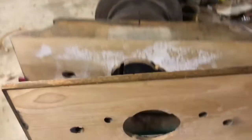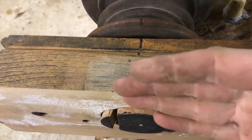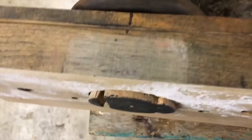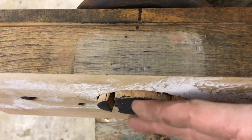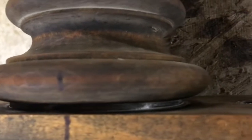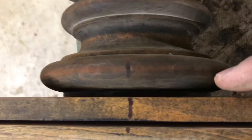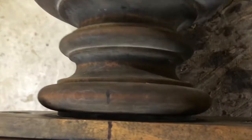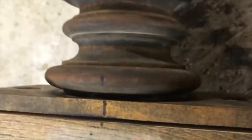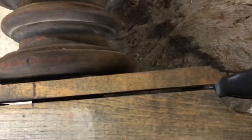All right, so I was able to get the outer layer of this leg off. And what that did was it gave this part enough access to where I could lightly tap it that way and allow it to slide up this metal peg that holds the leg together. And what I had to do is get some wood glue down in between this crack because I wanted the glue to be solid, you know, the platform of the round part to the platform of the flat part. So I put a lot of glue in there and I've got it kind of clamped together. So that one's drying